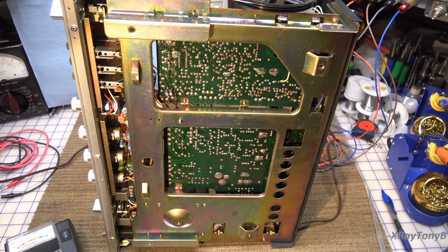However, if part of the power supply shorts out, that may not do that on the power amp, and at that point in time, it might just be that we have a capacitor or something that's beginning to leak, or high ESR or something like that. So we're going to look at that. But being how quiet this amplifier was, that may not be it either. So we're just going to divide and conquer.